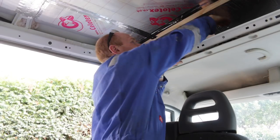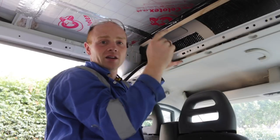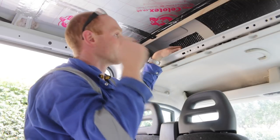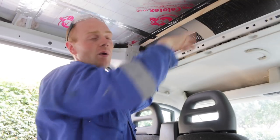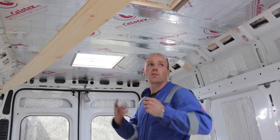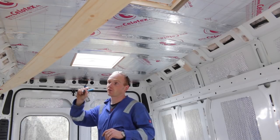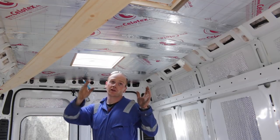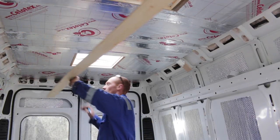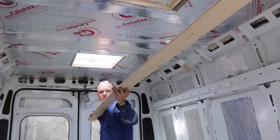So what I'm going to do is just measure how far the panelling is going to go through, because it may as well cap off inside there. We'll put some insulation in there to make sure we don't forget any of the areas of the van, especially up here — I really want to get insulation everywhere we can and make the most of this little space. So the first strip is probably the trickiest; after that it's going to be a bit of a production line. The first one's got to have the holes in for all the fixings, and it's also got to be perfectly central and perfectly parallel with the walls, because everything's going to be built off that. I've cut it to length already and I've made sure I've picked a nice straight one to start us off.